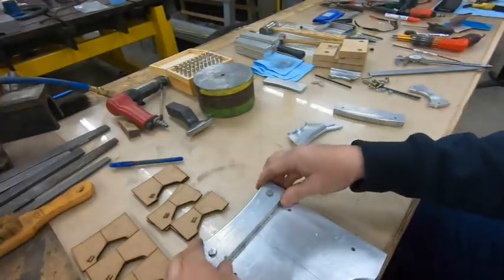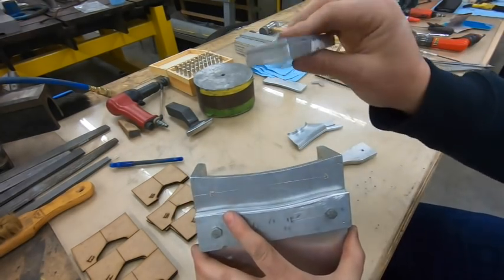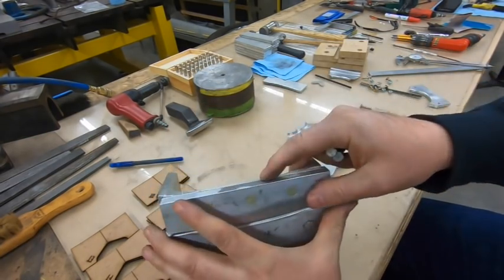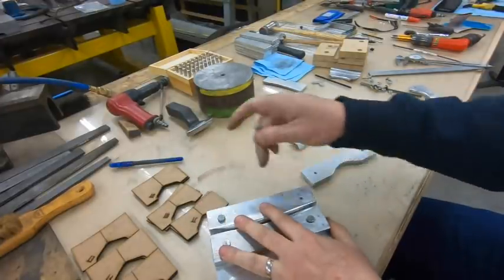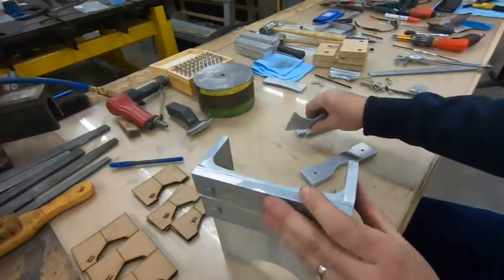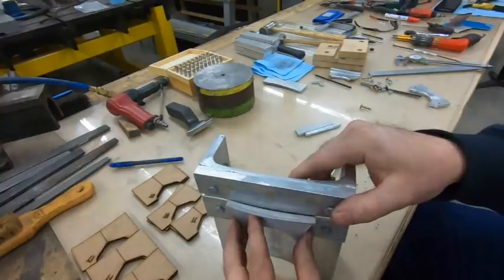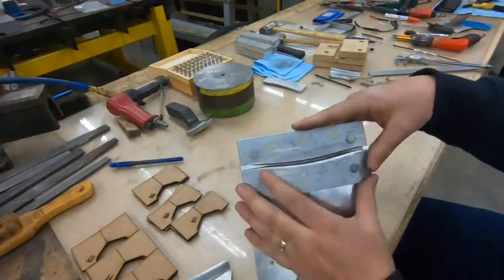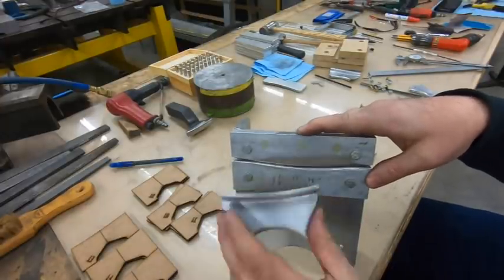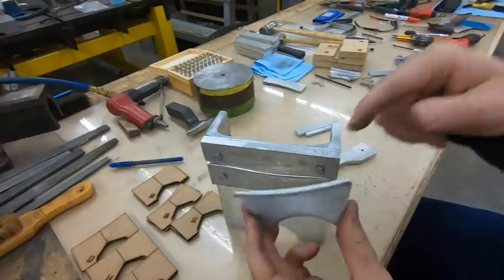The second stage of this form block is to move this back into this location. I ended up riveting it together to give me the correct thickness because I needed a half inch. This piece goes up here and allows me to bend over that second leg. Now this block doesn't match perfectly on these rear frames — it's the contour of a forward frame. So it's really crucial that I'm able to shrink that flange to bring it in and tighten it up to match the lower one on every specific frame.